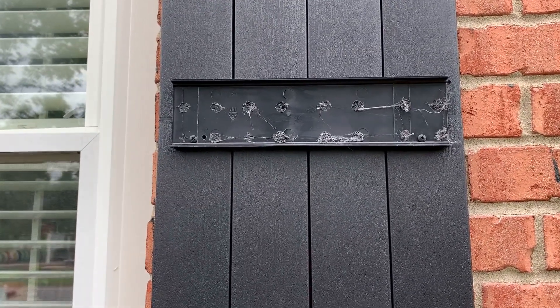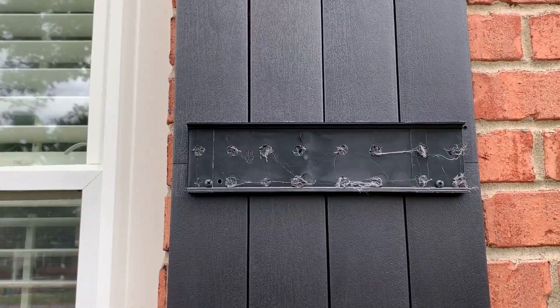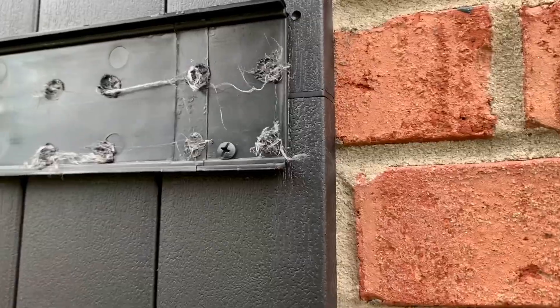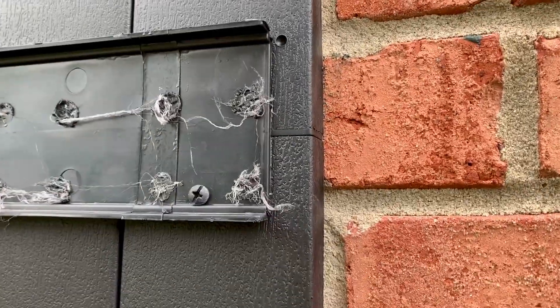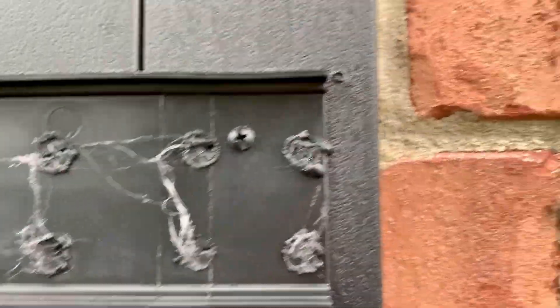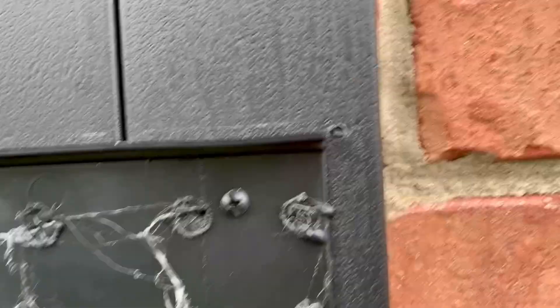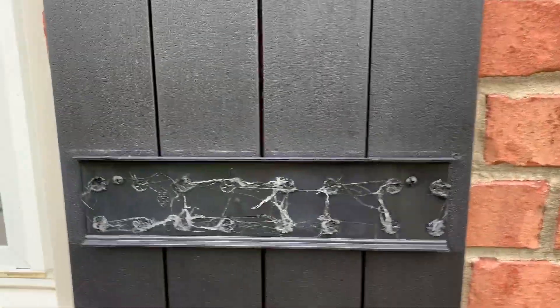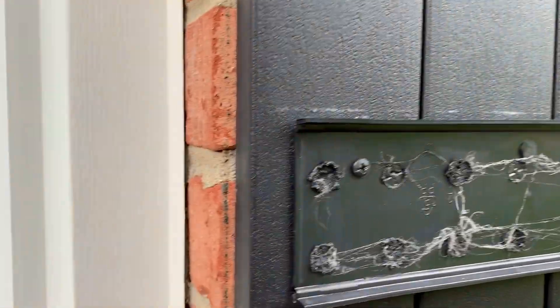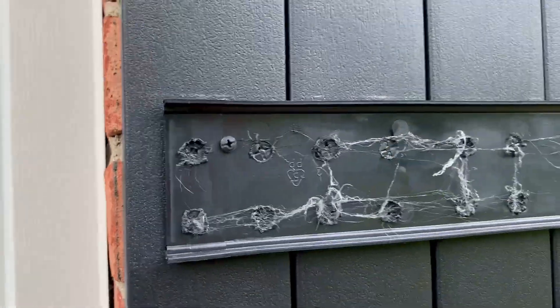One, if you're just using tap-cons, you can use tap-cons. But the other thing is that there's enough room to find the mortar joints — like here. You can just go into mortar joints, not worry about the brick. If you don't like drilling brick — I don't like ruining brick — possibility of cracking it, that kind of thing. Go into the mortar joints and use expansion anchors.